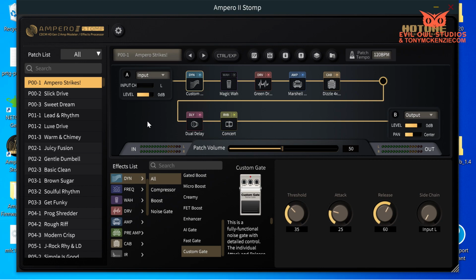Now, while we're in here, we might as well talk a little bit about some of the differences that are going on. For example, this is 24-bit, 44.1 kilohertz sample rate on this device. And yeah, very good. 20 hertz to 20 kilohertz, plus or minus 1 dB. Well, that's basically what you can hear. If it's beyond that, you can't usually hear anything. It's got a dynamic range of 127 decibels, digital to analog. Believe it or not, there are 460 effects in this unit, including global EQ. Don't know where they all are, but they're in here.